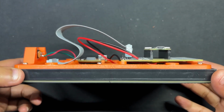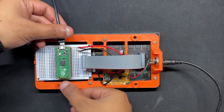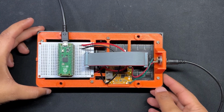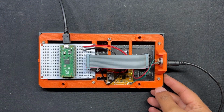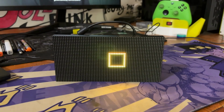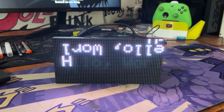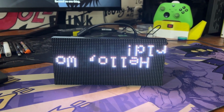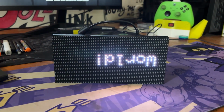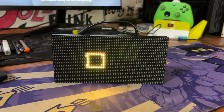After the matrix setup is completed, we connected the Pico to our computer to upload the code and plug the 12-volt adapter into the matrix DC barrel jack socket to begin the test procedure. We made this simple Hello World sketch, which initialized the RGB matrix to display a variety of colorful animations, including gradient, diagonal lines, moving shapes, expanding circles, and scrolling text to demonstrate the matrix graphical capabilities. Make sure to first install the Adafruit Protomatter library before using this sketch.